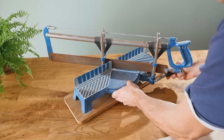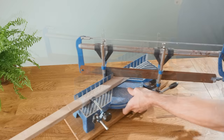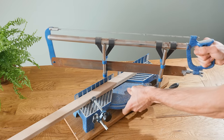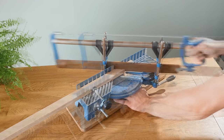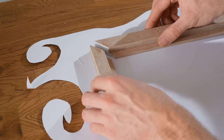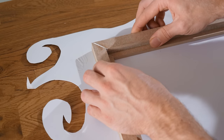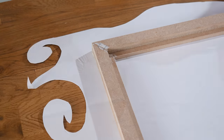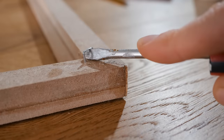You can do this by hand if you like, but for best results I recommend using a mitre saw. I found this old rusty one in a friend's garage, and after giving it an oil, it worked beautifully. More wood glue can be used to join these pieces together, and a good way of holding them in place as it dries is to use staples, which can be easily pulled out again once it's set.